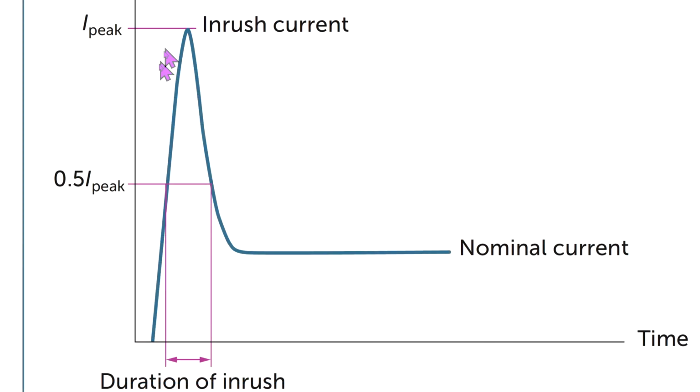And the reason for that is because of this inrush current. This inrush current for LEDs is in most circumstances more than 10 times the nominal current. And yes, it can even be 40 times and 50 times the nominal current. Because of that, we can only install fewer, even though the running current is so much lower than the circuit breaker's maximum capacity.